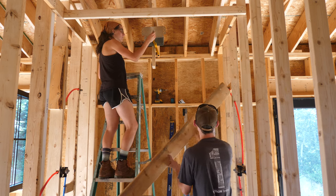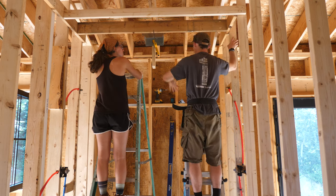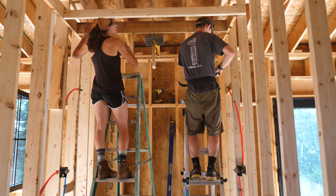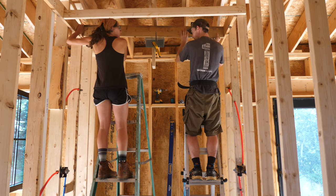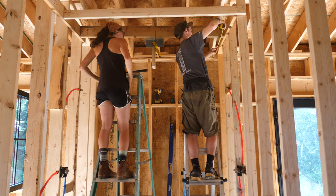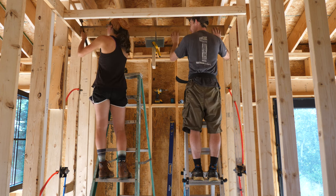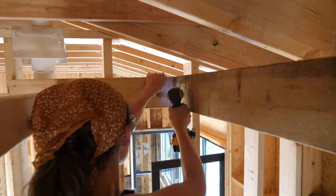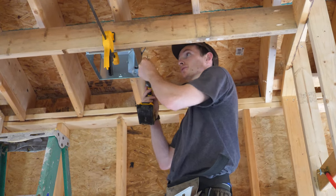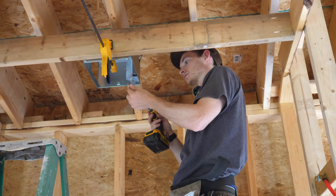I've temporarily clamped the box in place where it's centered both ways in the shower, and now we have a clear indicator of where our ceiling joist needs to go. We made sure it was square — the board needed to be adjusted on both ends to get the right measurement — and now that's not going anywhere. With the joist in, I went ahead and screwed through the mounting flange on the back side. After we insulate the ceiling, I'll put one or two more ceiling joists on the other side of the fan to support the drywall.